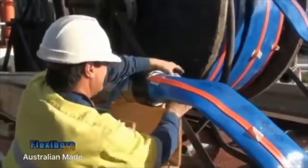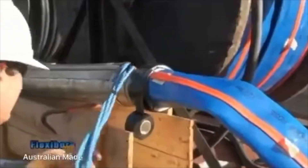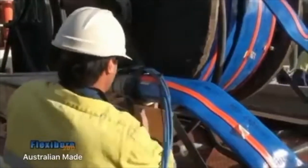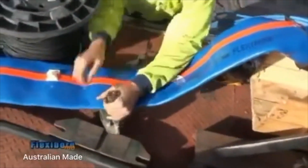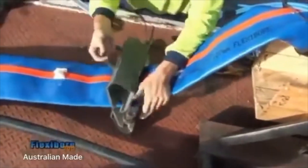Flexible hose is attached to the pump using the stainless steel hose clamps. The six screws are tightly secured using an allen key, and then the power cable is strapped to the coupling clamps using a waterproof tape. This will ensure that the cable will not rub against the bore casing. The first lifting clamp is secured to the flexibore hose.